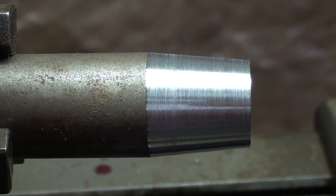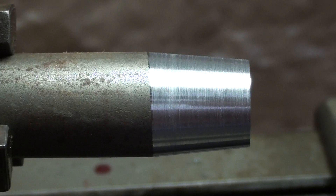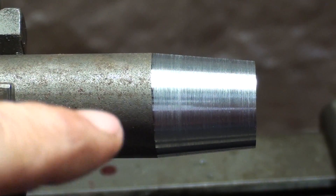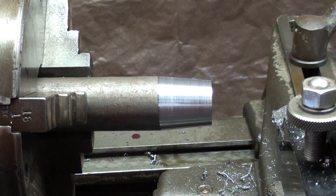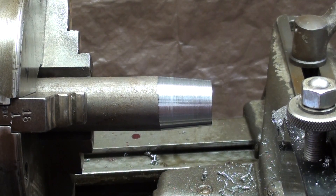As I rotate the chuck by hand, you can see it's a little ragged out here — that's because this chuck is very far off, perhaps eight thousandths. That doesn't matter one bit for this exercise, but you can see the taper forming here, and you can make it as short or as long as you want. Another nice thing about the taper attachment: if there were other operations to be performed besides the taper — for instance, turning a straight part here, or threading — that can be done without taking the work out of the lathe. You just disengage the taper attachment.